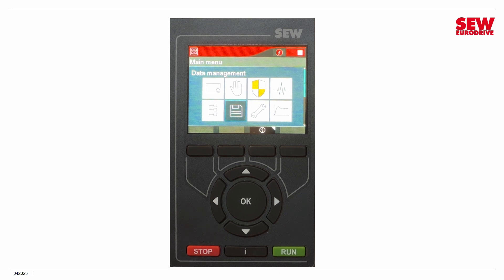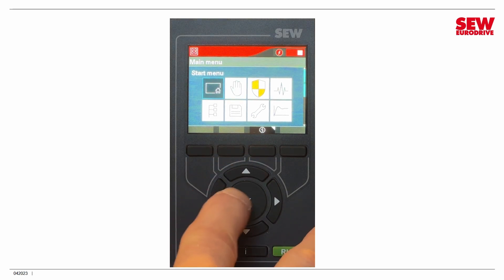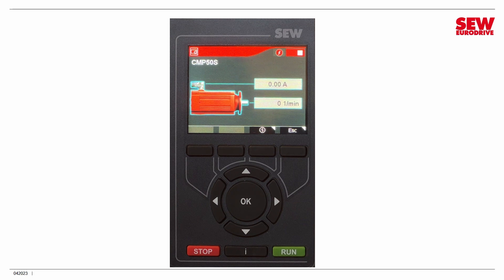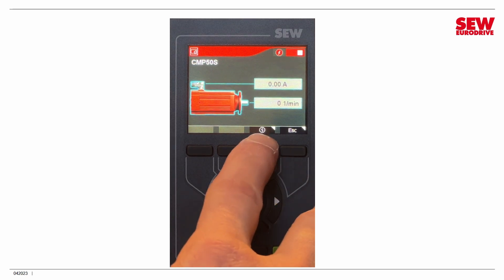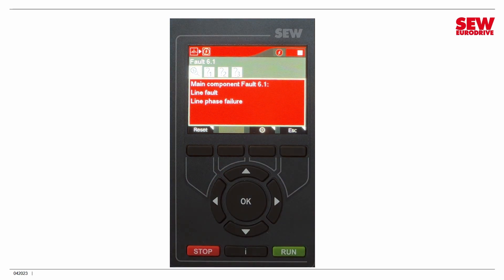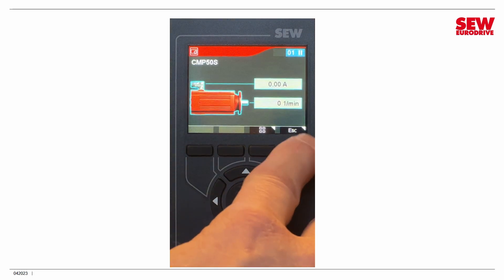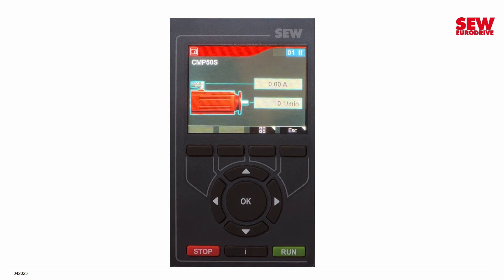Now let me show you how to go back to the status screen to watch the drive when it's running. Go to the Home screen, pick Actual Values Drive, and there you go — you can see what the drive is actually doing. You can also use this screen to clear faults. There is a fault here that I deliberately created — I plugged my VFD into a transformer rather than directly into 460 volts, and during the restore it did a factory reset and noticed it didn't have all three phases. You can see a little lightning bolt at the top of the screen and a function button lit up for fault. Hit that to pop up the fault message, click Reset, and it clears it. Drive is okay — that's how you deal with faults.